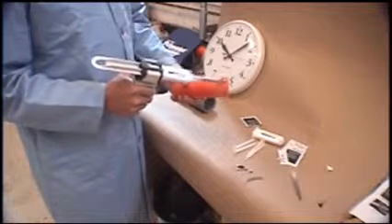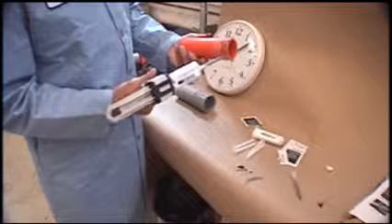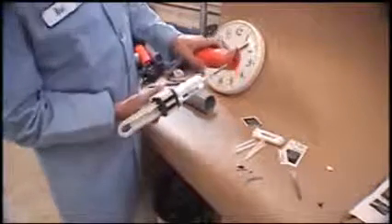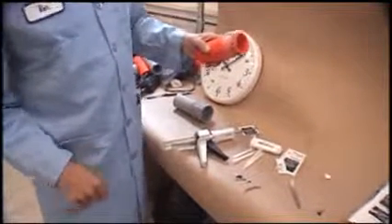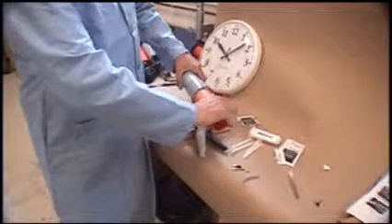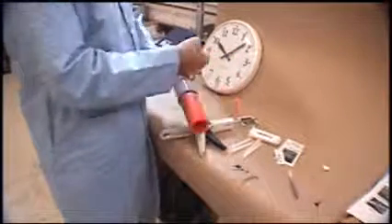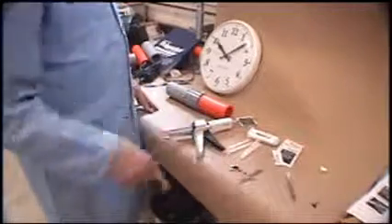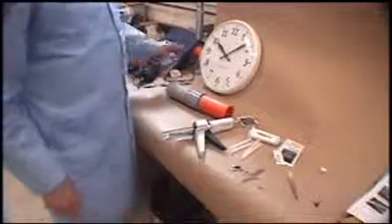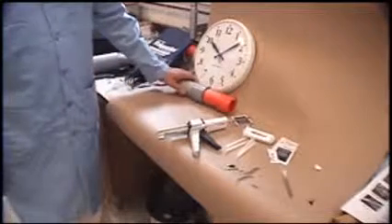Now we can do the other side. We'll make a zigzag pattern again — you can go all the way upside down. It's a very thixotropic material, so it doesn't drip. We can hang very well onto the piece. We'll try doing as much twisting as we can while putting the pipe together, then just run your finger around it to smooth it off. That is not necessary — it just makes the joint look good. And then we've applied it. We're going to let this sit for one hour and then do a pull-out test on this one.